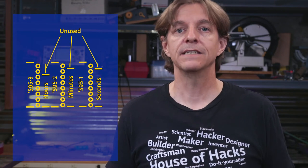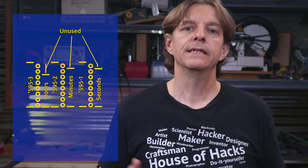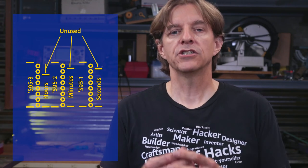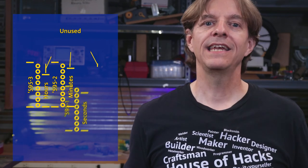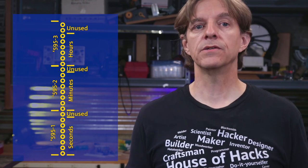Now let's revisit the design for this project. In the first video, I talked about the need for 20 bits for all the output: seven bits for the seconds section, seven bits for the minutes section, and six bits for the hours section. In my prototype, I sent those in a single stream, and that made for some messy code since the values weren't broken up into clean 8-bit values used by the 8-bit shift registers and internally in the Arduino's memory. To clean up the code, I changed it to control each of the 595s individually instead of chaining them together. This made the code much easier to read at the cost of using 9 Arduino pins instead of just 3. After the video, as I thought about it more, I realized that originally my idea to put all the unused bits at the end of the daisy chain was an unneeded constraint — there really was no reason for all the unused bits to be bunched up together; they could easily be spread out. This insight allows clean, easy-to-read code and still daisy chains the shift registers together using only 3 pins on the Arduino, simply by connecting the LEDs to the shift registers in a slightly different pattern.